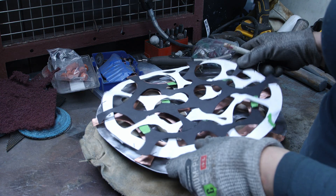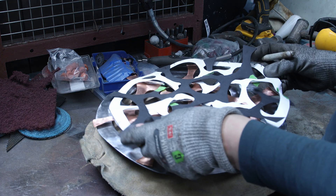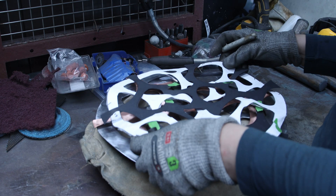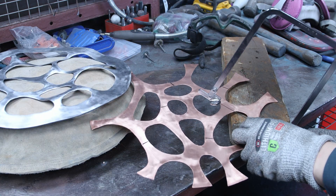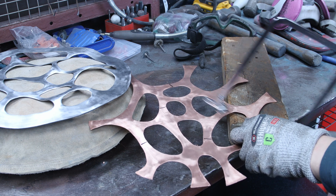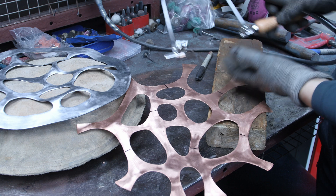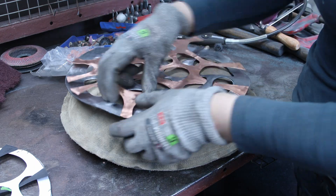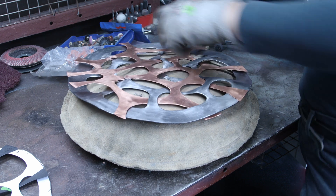I focused on which part of the black template goes under the white template. I'd used green tape which is visible, so I could spot straight away where I needed to cut, and used a marker pen to mark the line in each area. I wanted a nice clean thin cut so I brought my jewelry saw to the workshop — but I'd forgotten the replacement blade, and of course the blade broke on the first cut. I moved to plan B: the Dremel with cutting wheels. It did the job quickly, but left wider cuts — which would come back to bite me later.